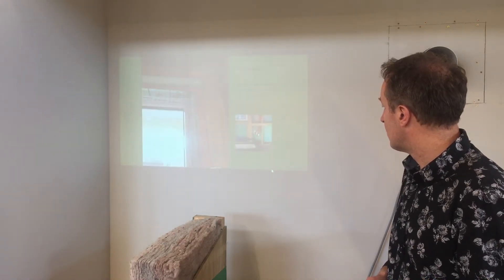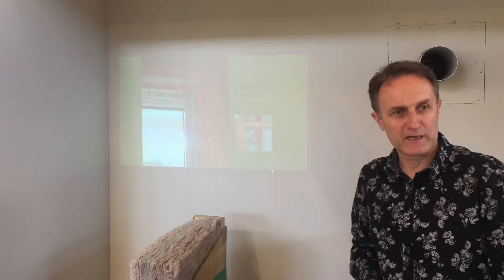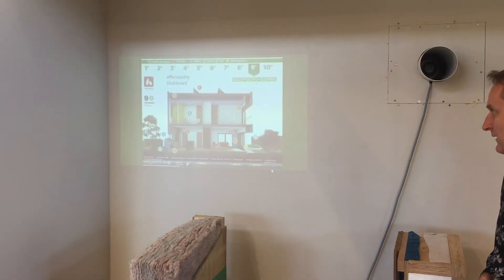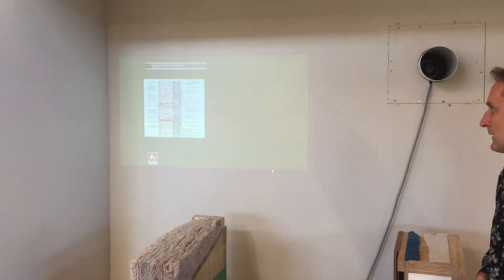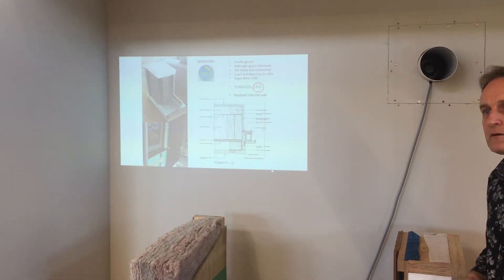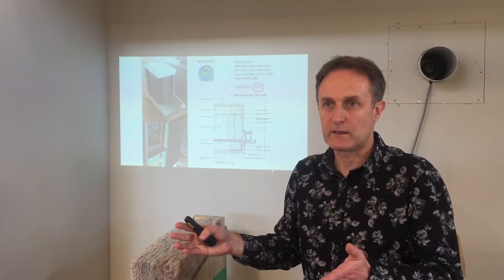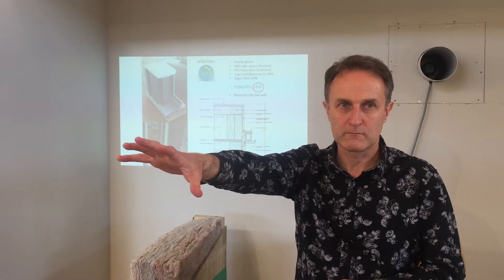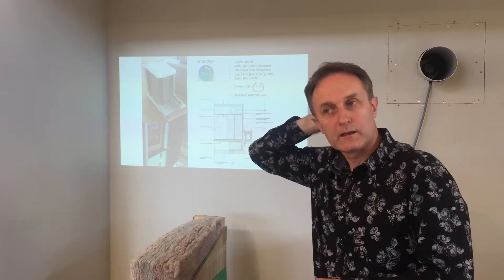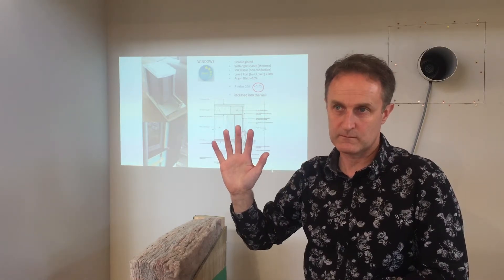Can you talk about the triple glazing? So the windows are really important. The orientation and the size of the windows — here we've got mainly north-facing glass, minimal south-facing glass. In the 10-star house we have no south-facing glass — there's never going to be any sun on that side. And recessing the windows is a key thing — it's standard practice overseas but pretty much not done here because we follow the New Zealand Building Code detail.